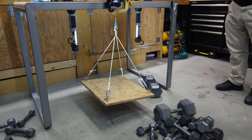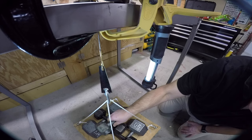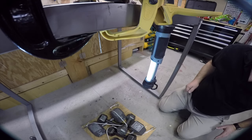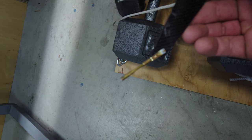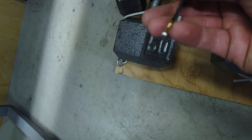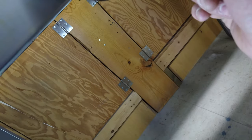Next is the Sullivan Golden Clevis in the smaller 256 size — we're only going to do one of these. The smaller Golden Clevis failed at 124 pounds, but it was actually the solder joint that failed on the rod rather than the clevis itself.